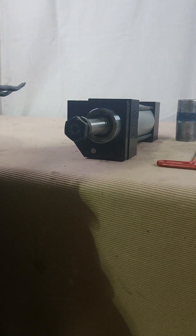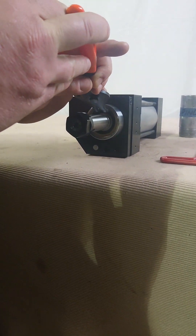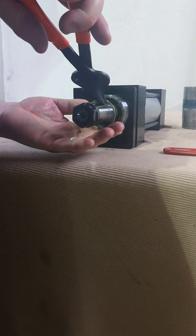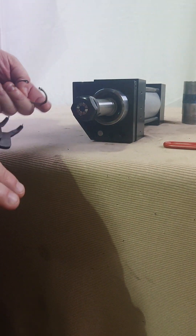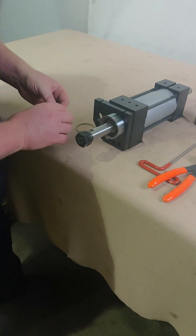Once we've loosened this screw, as far as the drill body is concerned, the only other thing we really need to do is capture our snap ring and remove it. If you have an ER-20 chuck, you'll be able to remove the snap ring and the wave washers from the spindle without removing your nut. However, we do recommend you remove your tooling for safety purposes.